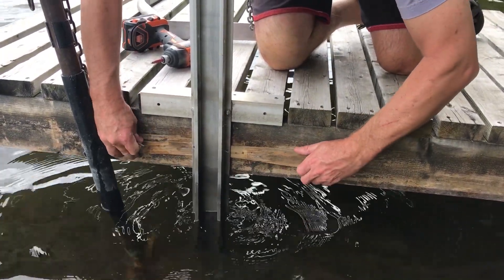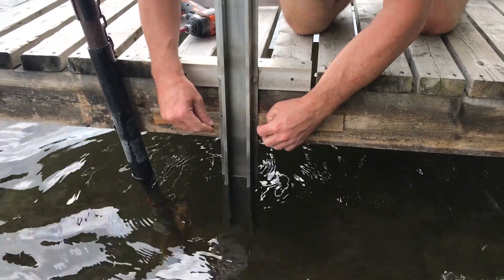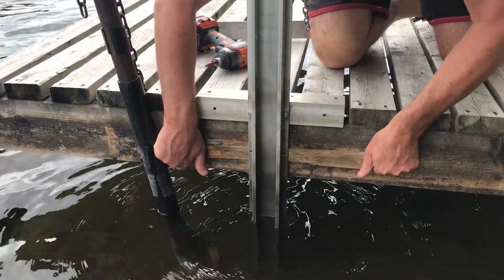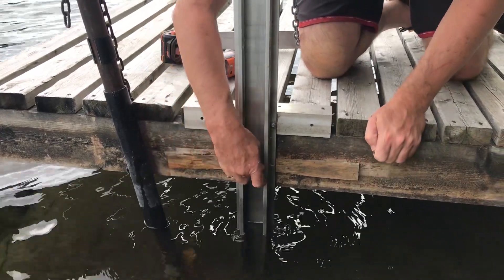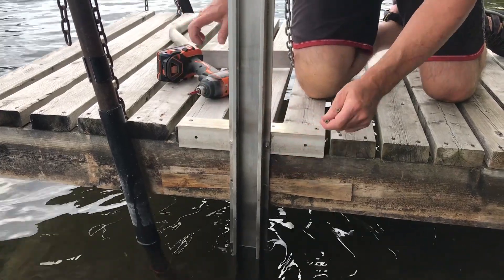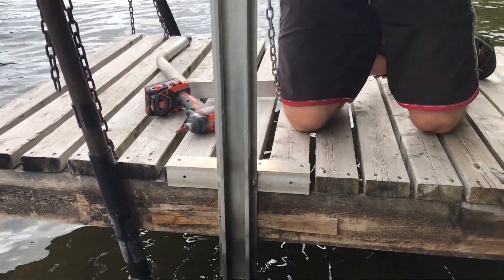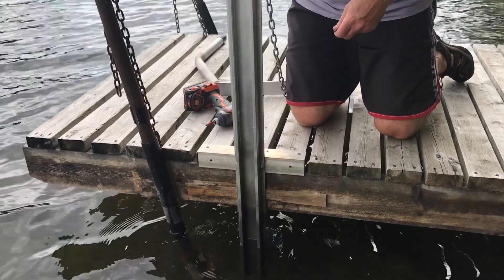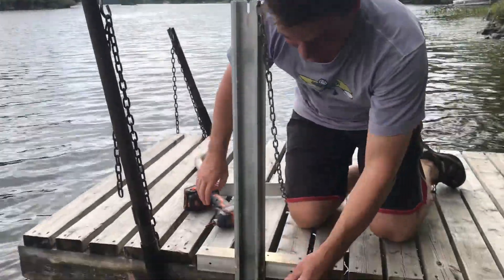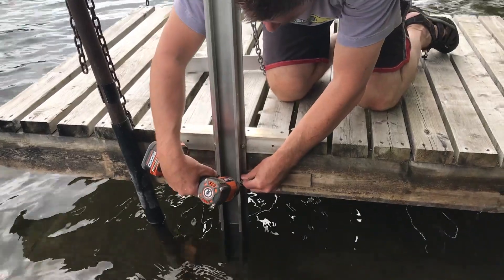You can see there — when I drive these screws, I'm going to drive them through the shims to hold them in place. I put them out a little bit stronger because when I tighten them they'll actually compress a little bit. What I'm trying to do here is make this so it's nice and stiff, nice and firm and vertical. I'm not getting out a level or anything like that, but I'm just going to keep it nice and vertical. Put these two in.